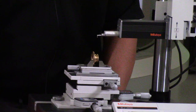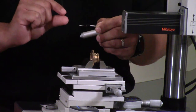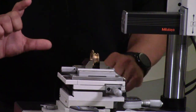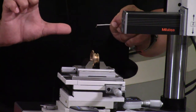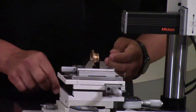Let's take a look here. We have our skidless stylus — that's getting in a millimeter deep into a part where there isn't sufficient area to measure otherwise. The tip is on an angle, and you can put that diamond tip right in the corner and maximize the area that we have to measure. So, a huge advantage.